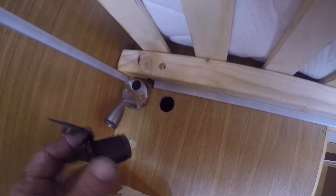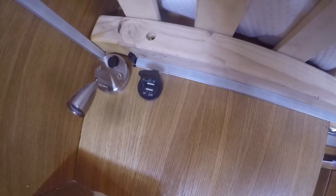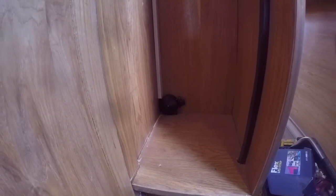So there's the strip with all the capping — the diffuser — all the way around, all the way up here behind me, back into the corner there. All I've got left to do now is the connections. My next job is I'm going to put a USB socket in here that takes 12 volt from the boat and turns it down to 5 volt — charge your phone or whatever else you want to do with it. One hole, one USB charger socket in there, stick the lock nut on the back of it — happy days. I've got an inline fuse on the bottom of that in the cupboard there that does the feed up to the back of that socket and the lights.